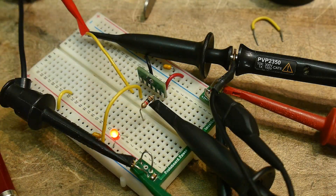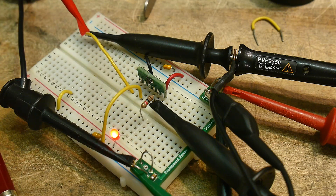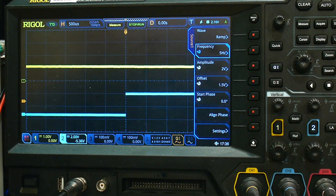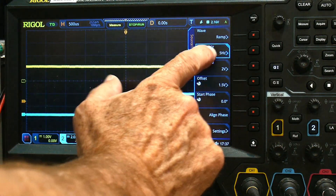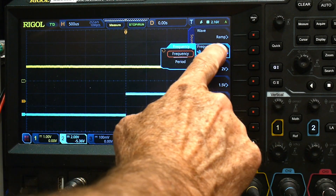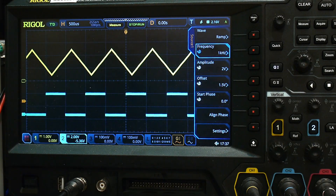Here I have the device. I have a clock coming in and I'm flashing an LED — input, output, that's all there is to it. Let me show you on the scope what's going on with the Schmitt triggering. I'm using the signal generator inside this thing. Let's change the frequency to one kilohertz. This is my input and this is my output, and you can see that it's acting exactly like a comparator.